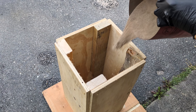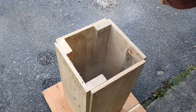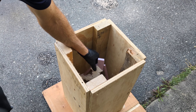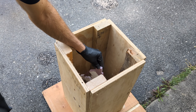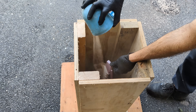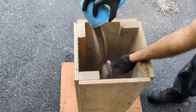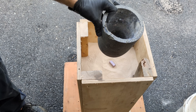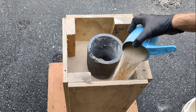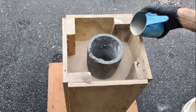I'm going to bring this out to the furnace and load the furnace with the crucible, but I'm not going to light the furnace yet. I want to prepare my mold prior to melting down the aluminum because this might take a while. I filled the bottom with some dry sand first to get the height that I need for this foam pattern. Because I'm using the large crucible with the hole cut out of the bottom for the pouring basin, I want to keep that inside the box as well, just in case the crucible breaks — it has cracks all over it and it is an old one.